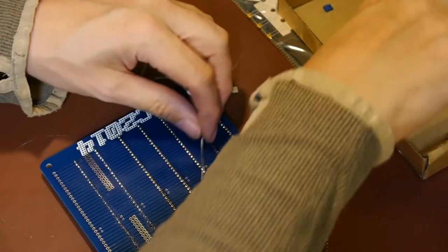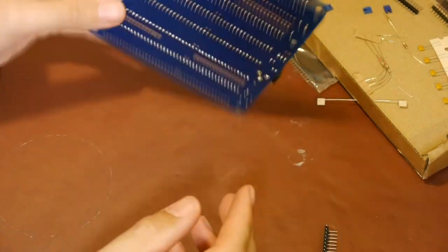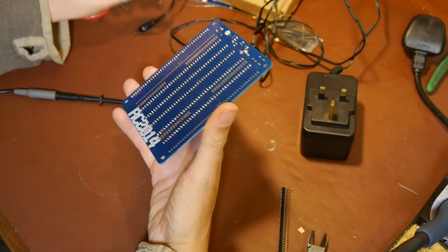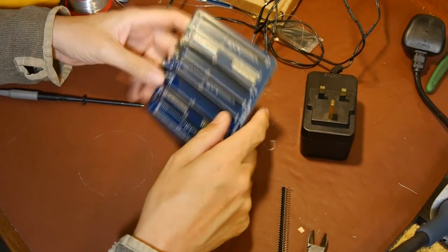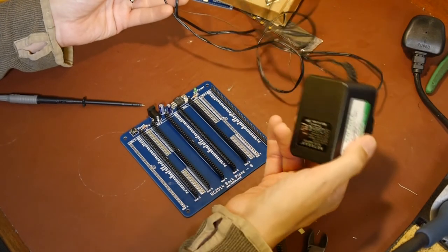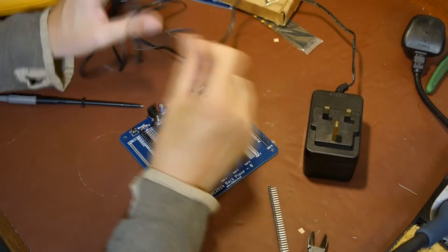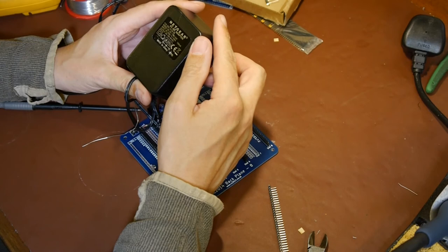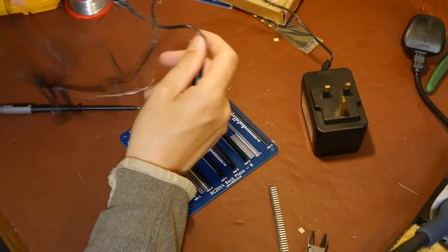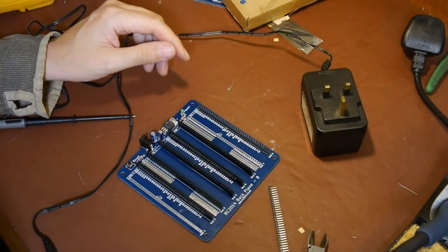I'm just lining up all the excuses for my soldering. I'll give it a last quick visual inspection under my magnifying lens, and if all's good I'll bring you back when I power it up. Normally I'd power this with my bench top power supply, but I forgot the 100 nano decoupling caps - we'll carry on. I'll just use an old Netgear AC-to-DC adapter, 12V at 1A.